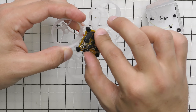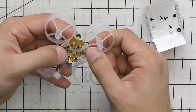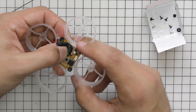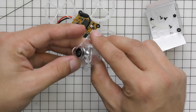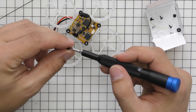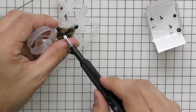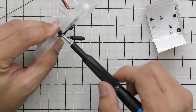Bring back our flight controller — you can see the camera is already plugged in on top of the FC board. I'm going to gently unplug that and set the camera to the side. Grab our Cockroach frame. You want to orient the USB plug to the back of the frame, which has two side little gaps. Tuck the battery connector into the left side gap — the Cockroach frame will just bend around it and it'll pop through, so the battery connector comes out of that little gap and doesn't get pinched.